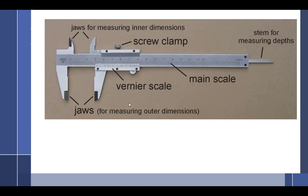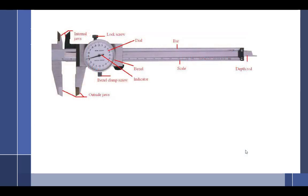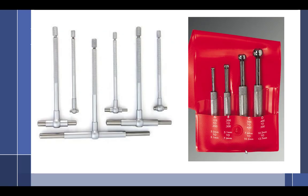But once a year, we would have a guy in a big old trailer show up, and he would go through and calibrate every micrometer, recalibrate every standard, and do the whole shop. These we did not do because they just aren't accurate enough. They tend to flex a little bit. They're good for machinist work, but not what you're supposed to be using for measuring crankshafts and aircraft engine parts. There's your dial caliper, and I'm not gonna take much time on that.